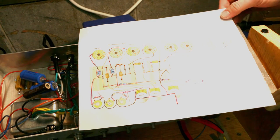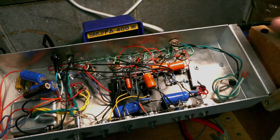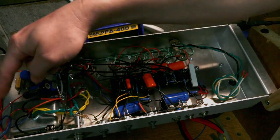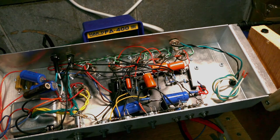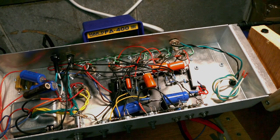That verification process is complete. As you can see I've highlighted everything and followed everything through - everything is in place. Next step is powering this on through the variac at low voltage, slowly bringing it up. I won't put any tubes in yet, so nothing will go past the rectifier, but at least the primary wiring and heaters should get some voltage. If there's no sparking or smoking at full voltage, I'll bring it back down, hook up just the rectifier tube, check voltages everywhere, then add the rest of the tubes.